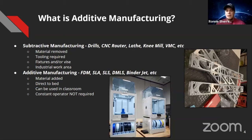What is additive manufacturing? Some people might be aware of it in a home or desktop setting. Subtractive manufacturing — it could even be a hand drill using a standard drill bit to take material away from a piece of stock. In an FRC setting it could be your CNC router for belly pans or two-by-one tubing for frames, lathes for shafts, knee mills like a Bridgeport, or a VMC like a Haas mini mill. These are all examples of subtractive manufacturing where you have a fixture or work holding and a cutting tool that removes material from a billet piece.